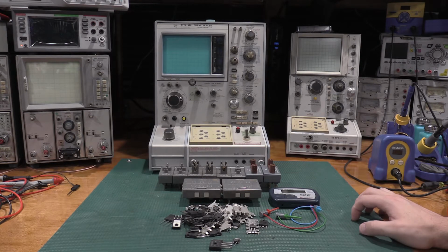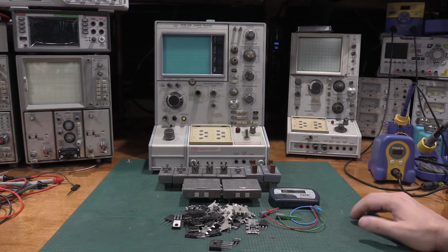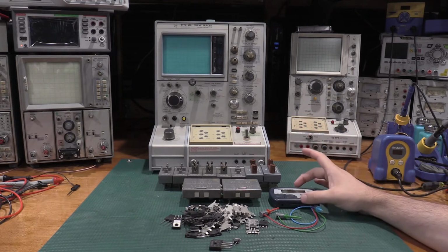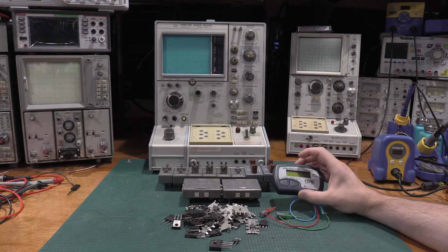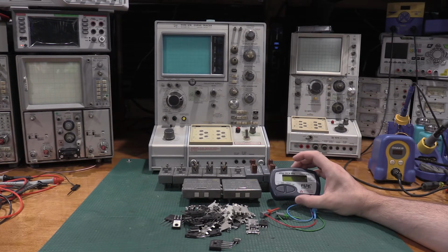Before I get too far into the video, I'll clear some space on the bench to make some room, because right now, you guys are sitting where I normally am sitting, right in the middle of the bench. We have an Atlas DCA Pro, the DCA 75, which tests 3-terminal silicon devices. It'll work on LEDs and diodes and things like that, but primarily small signal stuff. It can sanity check a power transistor for shorts and opens and things like that.